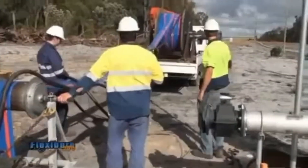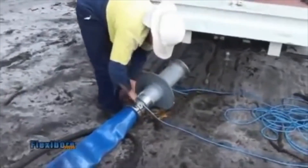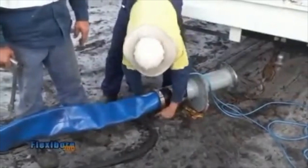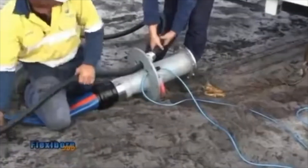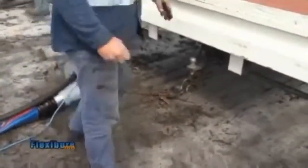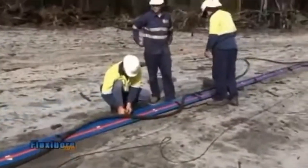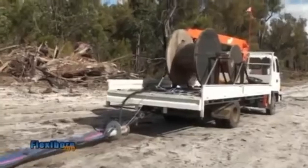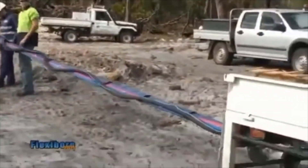Once again, another section of hose and cables are unwound and firmly secured. This cycle continues until the full 240 meters of hose has been unrolled. With the top coupling attached to the end of the flexibore, it is securely fitted to the well head plate or bore cap. The waterproof tape is used to secure the cable to the top coupling. With the flexibore securely fastened to the bore cap, the crew continues to use the strength of the hose in order to complete the installation. Note that no other safety cable has been used other than the hose itself.